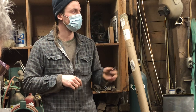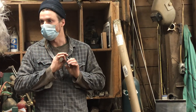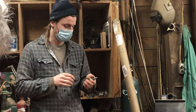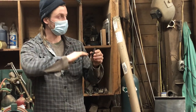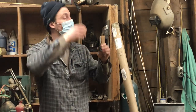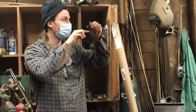If I'm cutting really nice bungs for finish work and I want stuff to be super crisp, and it's all going to be varnished or whatever, I'll take the bung cutter after I'm done and chuck it into the drill press, take the piece of scrap wood off the base of the drill press, and run it down right up to the edge of the iron of the bed.